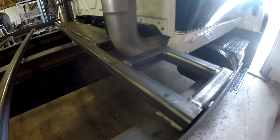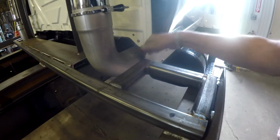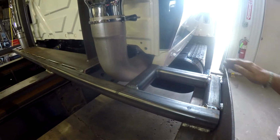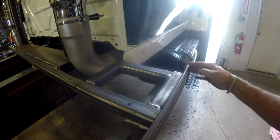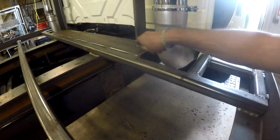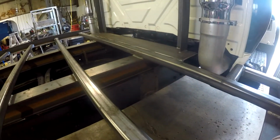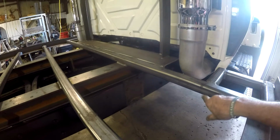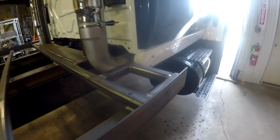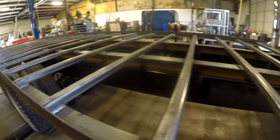So here is that other bump out. So again, that plate steel, it's 8 inches high, so it goes from the bottom up, and I'm going to taper it down so that it's the same width as this thing is. But then all the surrounding areas will all be 8 inches high, 8 inches from the bottom of here, so it'll stick up 6 inches above the tube steel. Yeah, but there it is.